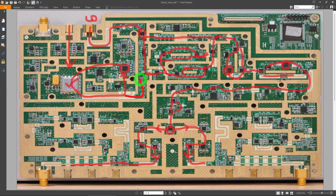This signal comes over here. It either goes this way directly, or it goes up, goes into the RF of this one, uses this one for down conversion, and then it goes this way. And then they join all together here anyway. So this is essentially to cover anything from 9 kilohertz to 8 gigahertz.